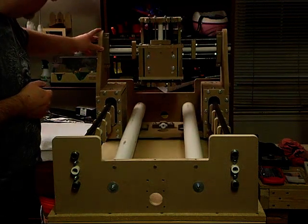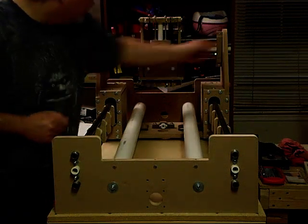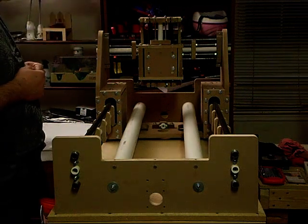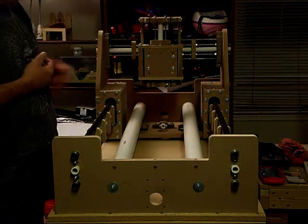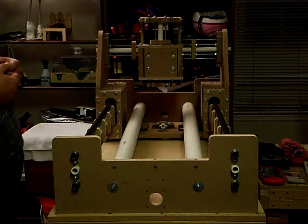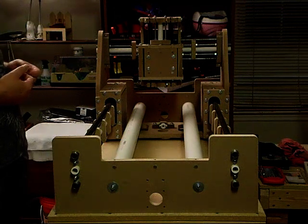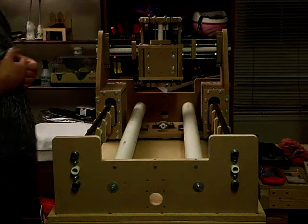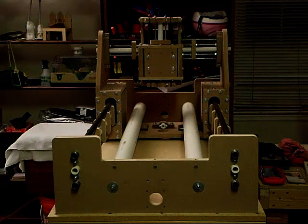You can see on the back and on the front, I am using clamps to basically help secure the pipe in place — it adds a little thickness and makes it sturdier. I also have a similar clamping arrangement in MDF for the other gantry plates. I had to be careful to keep those from cracking, and I managed not to crack it this time. I did crack and split wood three times — not sure if I was torquing it too much or had an alignment issue — but I just used super glue, a clamp, and a heat gun to reform the MDF, and it actually worked pretty well. I would not recommend breathing the fumes from that though — it is kind of toxic.